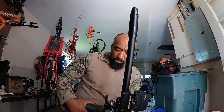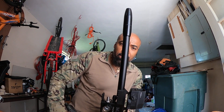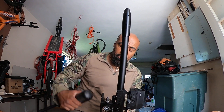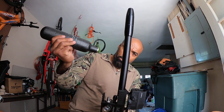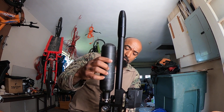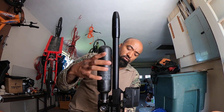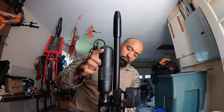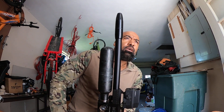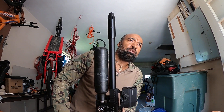I've got water in my bottle, in my regulator, in my plenum, and in my second stage regulator because I was using that hand pump. The water isn't apparent until this thing cools down. The same thing is happening to your bottles when you try to dry high pressure air immediately without it sitting in a tank.